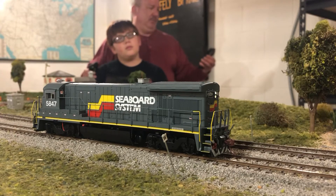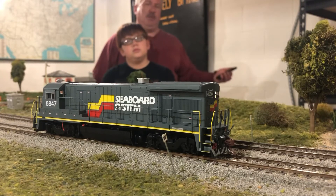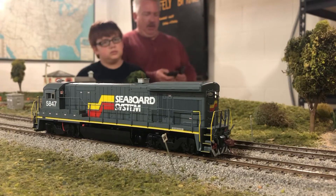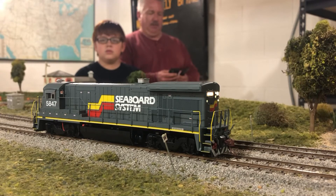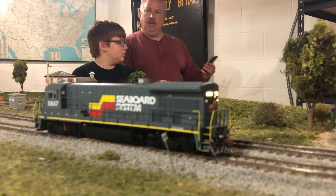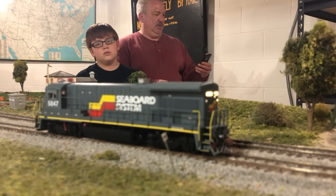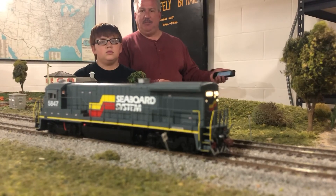So what I did is we moved the wiring for the rear class lights off from Auxiliary 5 to an open pad, which was Auxiliary 4. By doing so, we were able to get our number boards, rear class lights, along with all of our other great Soundtrack sounds. Simple as moving from Auxiliary 5 on the motherboard to an open Auxiliary 1, 2, or 4 — we used 4 — for a simple three-minute fix.